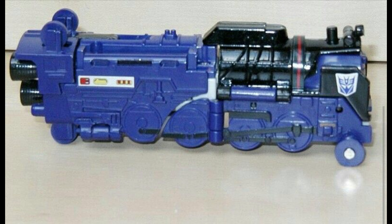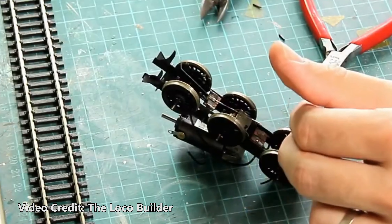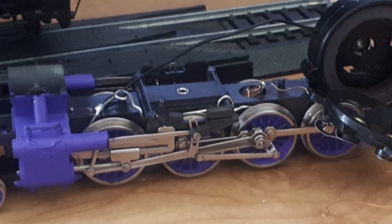For a proper Astrotrain, we need to be independent of the tender. So that was my first hurdle — learning how to wire up consistent pickups from the isolated drive wheels. After watching a few tutorials, I started with nickel-silver beading wire. I shaped it to conform to the chassis, poked it out to make contact with the inner surface of the wheels, and applied it to all four wheels. This worked! For a whole three minutes!